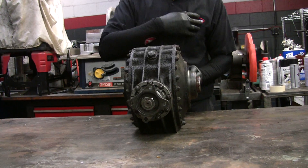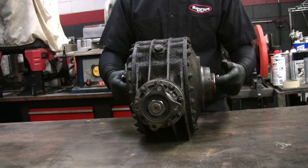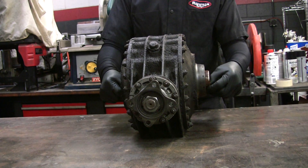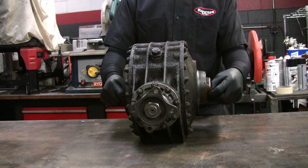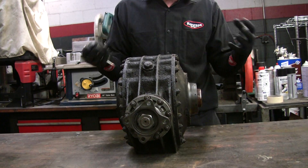This up here has two seals. They're leather from the factory — even the new ones you buy now are leather. So if you want to even have a chance of them working, you have to soak them in oil before you install them so they get soft again.